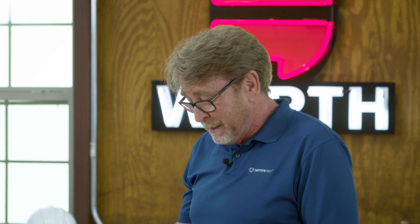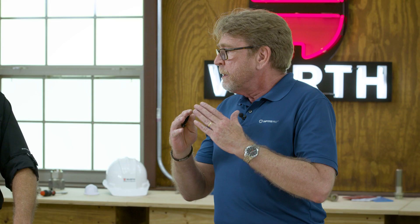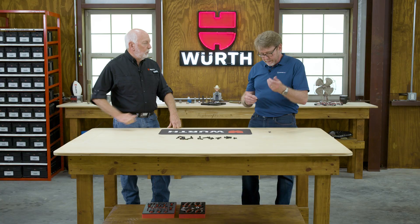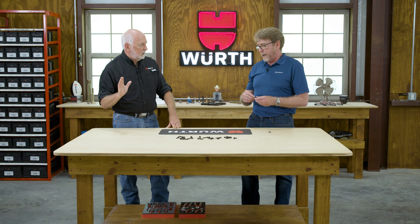We have a very unique thread design. He had his thinking cap on when he started this one. We had some great products in the past, but this one he really thought about how the thread could form. We wanted to keep the same surface area contact with this feature of the thread. So we kept the same prevailing torque and the other features that we had with other thread rolling fasteners — important to eliminate thread lockers. We have the same prevailing torque, even though it's a more rounded body. In fact, it's improved a little bit.